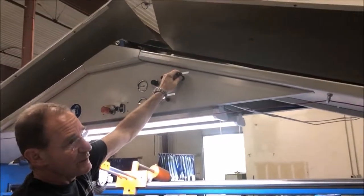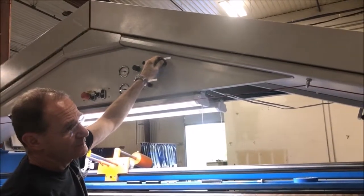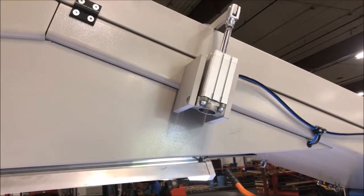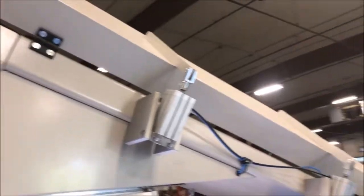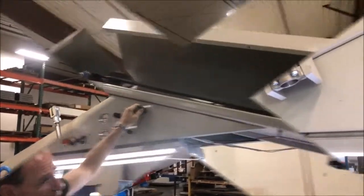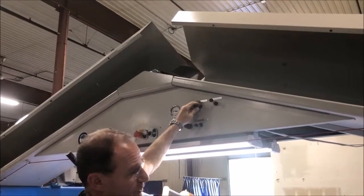You see right now the machine is up with the door open. You have a very simple lever. These are the actuators on the back of the machine for opening up the covers for the belt access — very simple and straightforward. Four actuators, two on each side, so there is nothing that you need to lift for the belt change. And then you can relieve your belt tension and take the belt off and put another belt on.